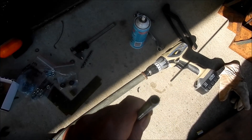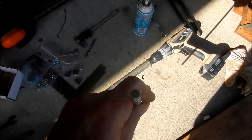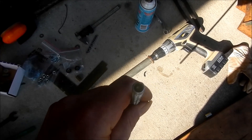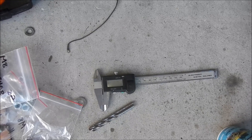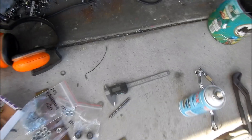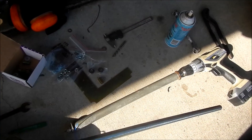So I spun the rod and ran the drill bit into the end. I did encounter some problems getting a centre hole in the end of the rod to begin with — it's very hard to get it exactly precise. I do have some digital caliper gauges and I got it within 0.02mm or so, but it wasn't spot on. And a little bit of wobble on this thing is going to kill the whole project, so it's got to be perfect.